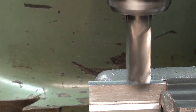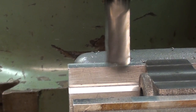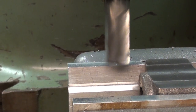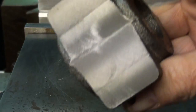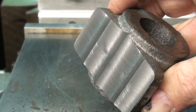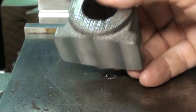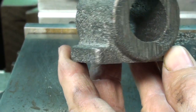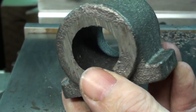It's cleaned up nicely, so I'm done. There's no need to take another cut. Remember that with cast iron you do not need lubricant or oil — it is self-lubricating because of all the graphite and carbon in the iron. And there it is. Decent finish, although finish is not critical at all. Sets nice and flat. And this is the basis now for holding it, because we know that the base is parallel with the bore.